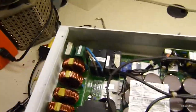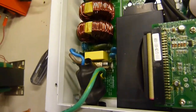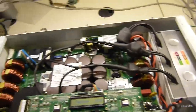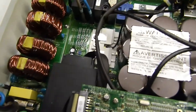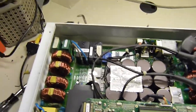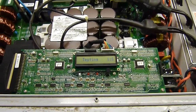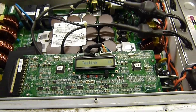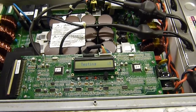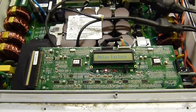This is good. If that was just temporary, or maybe there's just some crud in the relay contacts, maybe all the jostling during shipping knocked the crud loose and now it'll work again. You can see there is a fuse down there, which is good because I was really not wanting to have to unbolt all of the power semiconductors to take this board out. Almost done with the testing. There's our relay failure.